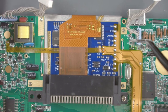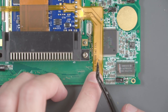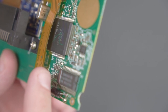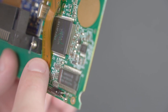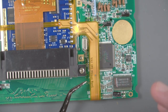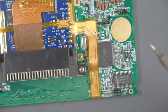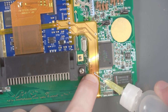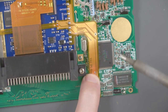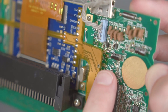I thought we were finished, but I missed two pads on this ribbon cable. If you look down here by this text, there's a small via on the ribbon cable — there's a small pad called T10 that we're going to have to solder that via down on top of. So add some flux to T10, then using some tweezers, push down on the ribbon cable gently, try to line up the via with that pad, and go ahead and add some solder. Now with that point soldered, we have to do one more up here — this one is called FB1.